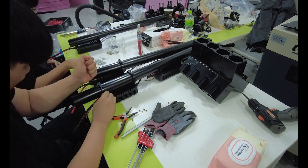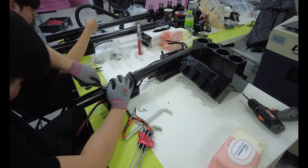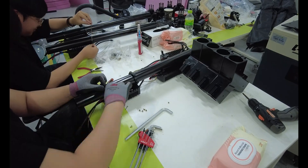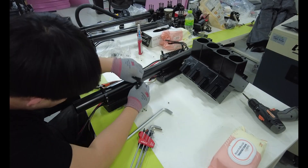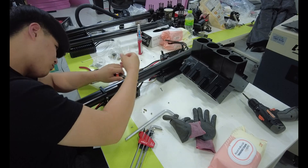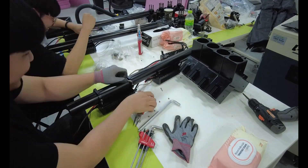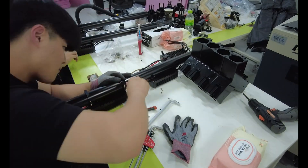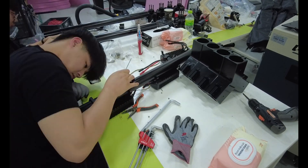Signal and power lines are completely separated. I've had EMI issues before — not again. Every wire is braided, secured, service looped and double checked. I treat each arm as its own sub-assembly. If I need to service this drone on site, each arm should be individually removable and testable. Fast motion makes this look easy, but honestly each motor took me 30–45 minutes.